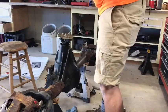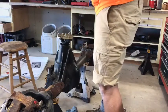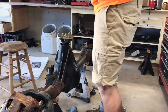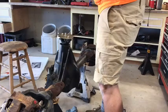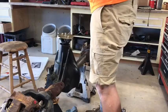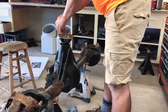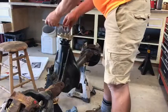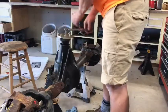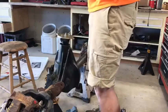I can adjust my torque wrench back down to 20. At 20 inch-pounds, it's still not clicking, which means I know I need to take a shim out and see if I can get into that range.